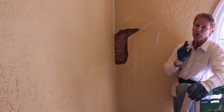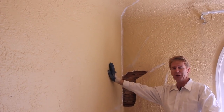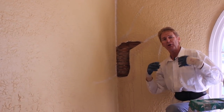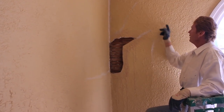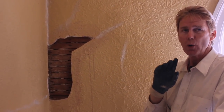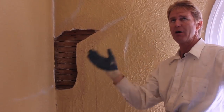Today we're going to show you a real technique — this is a knockdown dash, it's interior. This finish is about 90 years old. It has many coats of paint on it. I spoke with the homeowner and said, do you see this patch here? He said no, and I said good answer because I can match textures very well, but we have about 10 patches within a wall here. When you have so many patches within a wall, it's tougher to do it. It's best to tear it all off and start fresh.